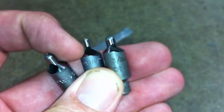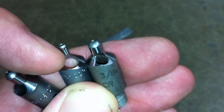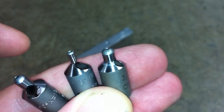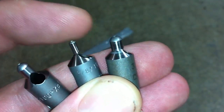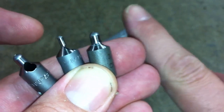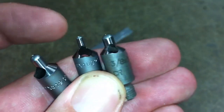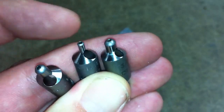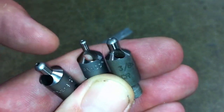You do want to use the right size pilot for the hole that you're using. The tip is cut away quite a bit — that hole actually goes through the pilot, especially on these small ones. You have to be careful not to get a side load; you don't want it in a hole and then get it cocked over because it will break the tips off, especially these little number 40s. That's why a lot of other companies don't sell them — it's just a fairly high failure rate — but we think it's important to be able to do the best quality work you can.